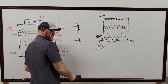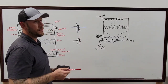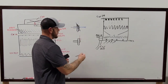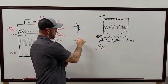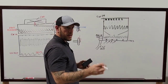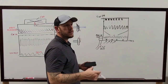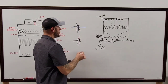There's a lot of things to check on. That's actually why I prefer the other laser alignment. The blue one. Yes. What we're talking about with the blue laser alignment is that one actually sits into the V shape of the pulley itself. So it comes with little V tabs. You have to find the right size tab for whatever pulley you're doing. A, B. Exactly. Most of those pulleys have the numbers on them pretty easily for you to be able to see. You just figure out which one fits on there the best. You'll know if it'll shake or it'll wiggle in there.